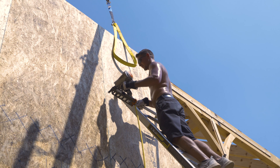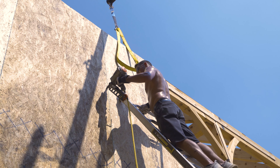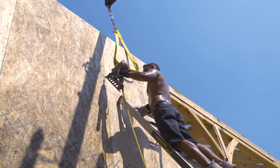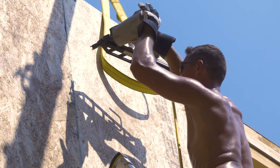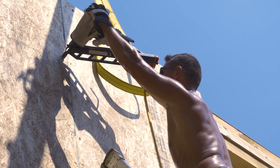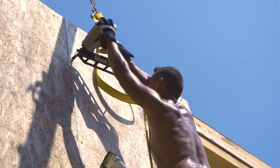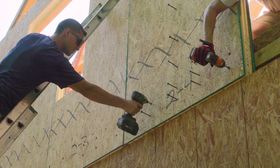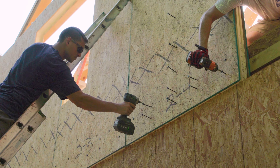You don't have to nail or screw the splines right away. Most installers find it faster and more productive to leave that part until a section is complete or even after all the panels are installed. This way, if you need to make an adjustment or fix a mistake, the panel screws are easily backed out and the adjustment can be made.